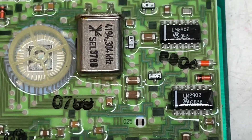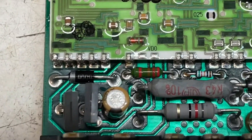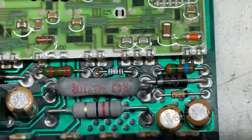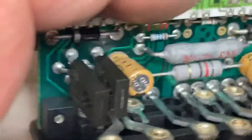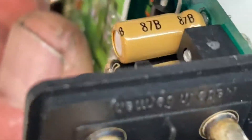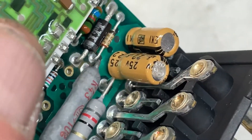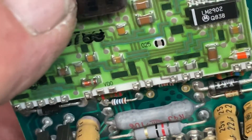There are probably some capacitors on there but they would be almost impossible to exchange if they go out, so we're going to replace these three capacitors. I'll test them quickly. The first one down here next to the transistors is 2.2, then we have the one in the middle which is 22, and this one here we don't know until we desolder — we can't read it. They'll probably be about the same size; they stabilize input and output signals.